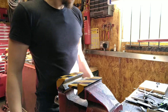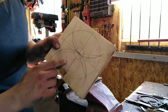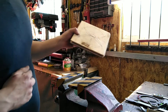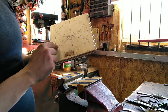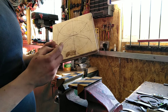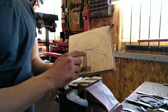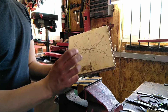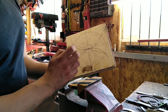I'll probably move on then to the middle part of the hub and try to record that as well. So we've worked out the six points - you can see the spokes - and I've worked out the size of the hub, just marked that out. That gives me an idea of the length of the spoke before it comes into contact with the hub. My idea is to cut all the spokes just a little bit longer than that length so they're in contact, weld them, and then put a cap either end - turn the hubs on the lathe, stick the wheel in the lathe, drill it, and press the hubs either side.